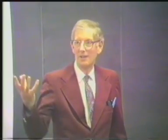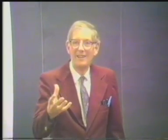Ground it, you know? But anyway, basically, it was a very, very poor blade design. The root end of the blade just wasn't suitable for what we needed. So we had a very quick redesign, which took all of 3 weeks, I think. It took a number of weeks to get the new blades, and that's when we went from 24 hours up to 1800, and still going strong. And it just shows what a little bit of minor design change can do. It didn't add any weight, and yet I can't understand why they designed blades like that, but that's the way it goes, because they didn't have to worry because they had hinges anyway.